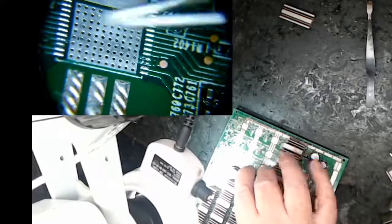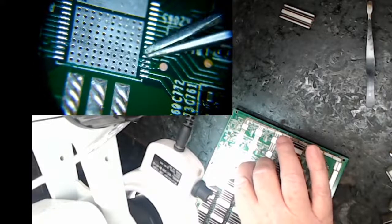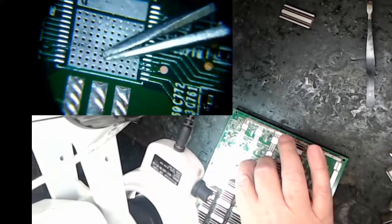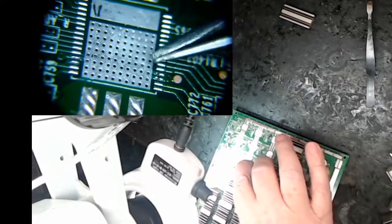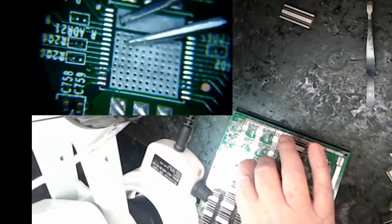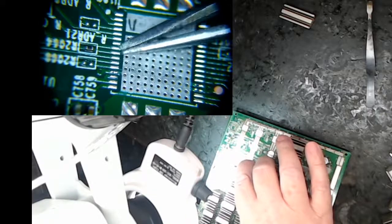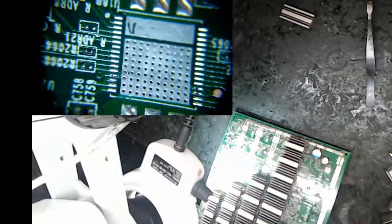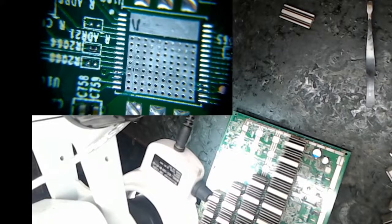So what you'll see, I'm not worried about this. This will melt. This looks pretty uniform, which is nice. The only problem with these sticking up is when you're trying to slide the chip around and position it, these catch the chip legs that have been tinned, okay? But these have a lot of solder, but sometimes you'll see these don't shine back at you and they're flat. That means there's probably not enough solder on it. So you might want to think about re-tinning them.